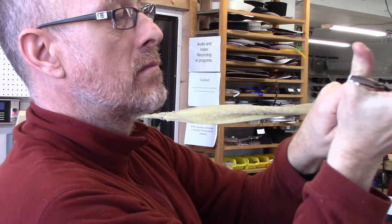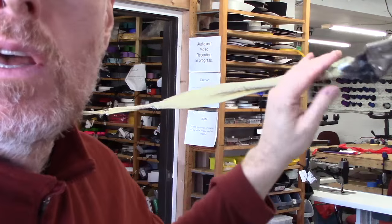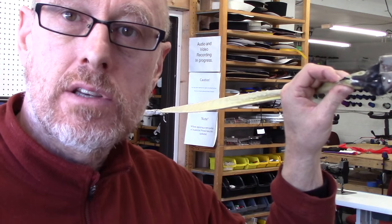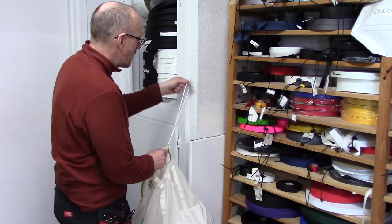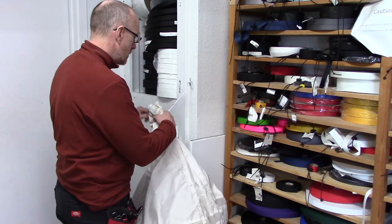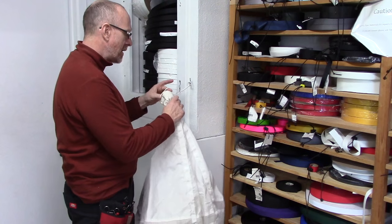Now, putting the end under tension — immobilizing it at the link — I'll go check on the other side and I should have an inch and a half from the guide grommet assembly to the lark's head. Let's measure it from the guide grommet assembly to the lark's head — and there it is, an inch and a half, nailed it. Now that we've set the drogue in the kill position, we're going to put the green mark on there so we know that it's cocked. I'll remove it from where it was immobilized on the bridle and instead immobilize it on the ball handle.